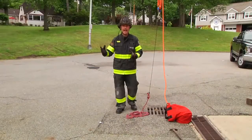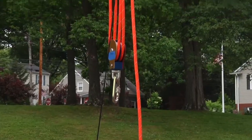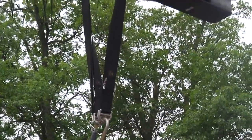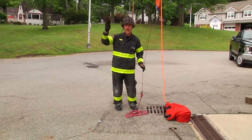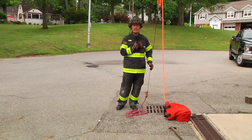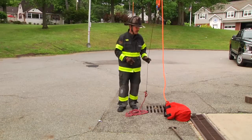We just got the tower ladder in position over our confined space. We created our high point anchor. As a tower ladder officer, how you can assist maybe the special operations unit or the tower ladder chauffeur, things you ought to know. First thing is positioning. You want a direct contact with your operator on the pedestal, have some hand signals. The portable radio traffic may be heavy, so working eye to eye with your operator.